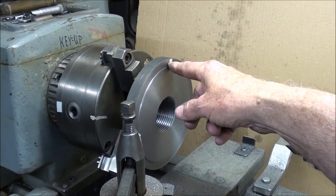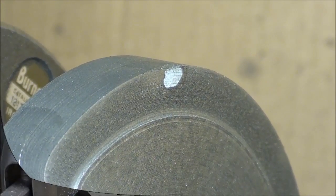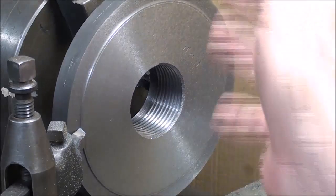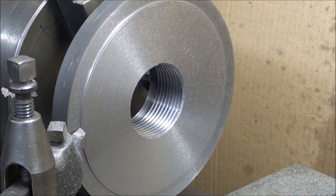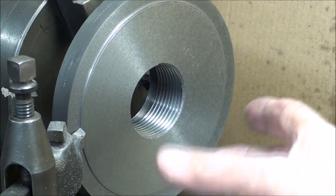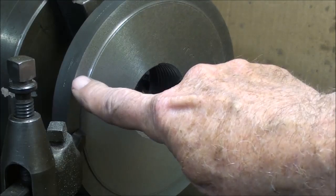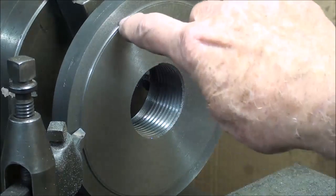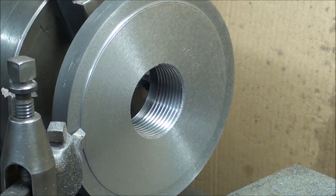I don't know where I got this plate — at an auction — but it's clearly marked India, and as I started machining I ran into a cavity that they'd filled with body putty. Surely your sins will find you out. To locate this step, there wasn't a good way to lay it out since I no longer have a center. So I just roughly made some grooves until I got the approximate measurement, checked it with the caliper, and at this point it's extra large. I'll remove about an eighth of an inch, then use the caliper to turn the step to the final dimension of 5.115.